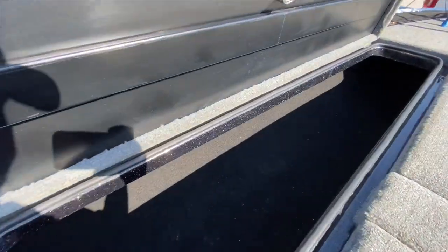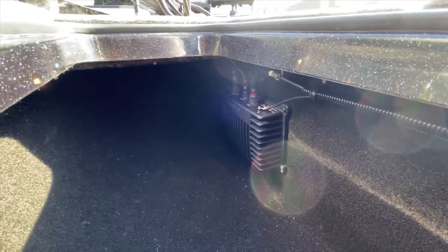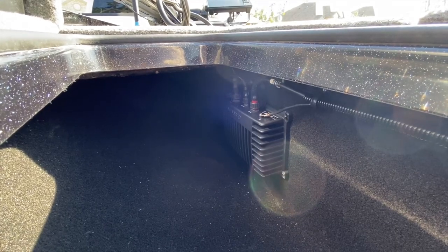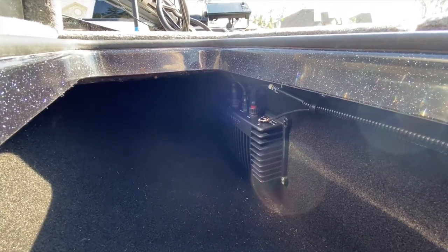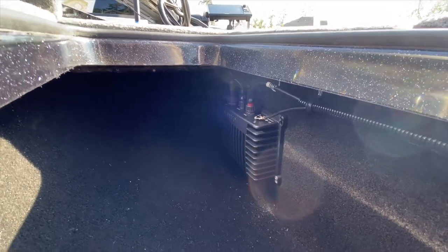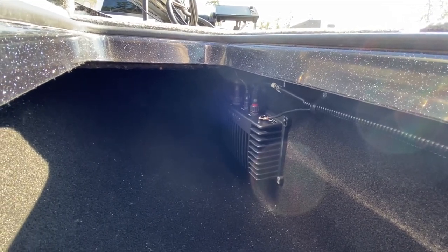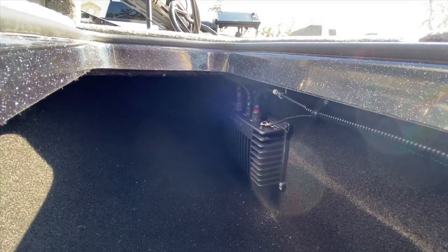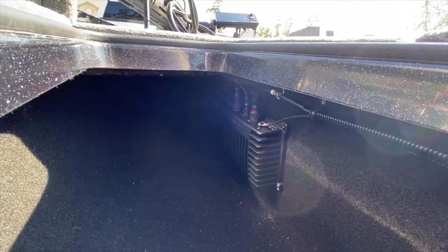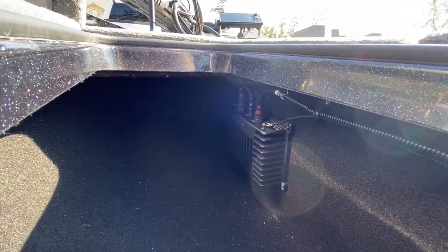I went ahead and mounted the black box GLS-10 in the same compartment as the battery box, just put it way up forward in the bow. The screws will pop through into the center compartment — I used three-quarter inch screws on the top, and since it isn't really flat, I had to use one-inch screws on the bottom. Later on I might replace them with a bolt and a nylon nut for a cleaner look inside. But you're limited on options here, and I was able to keep all the stock wires with this setup.